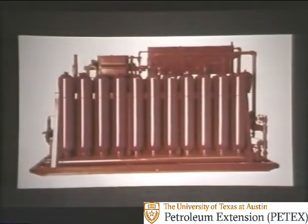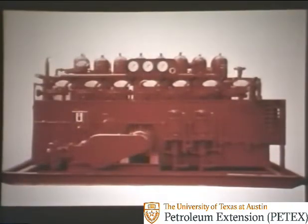Usually, a large number of bottles are used for safety — just like a multi-engine airplane where the other engines continue working even if one fails, several bottles provide safety in numbers. These bottles are totally safe; they cannot be disassembled under pressure, but they can be repaired in the field. Field replacement of the bladder is easy and can be done in an hour or so. After repair, the bottle still retains its Coast Guard or ASME approval. All accumulators work on the same principle, so what is said here pretty well holds for all types of units.